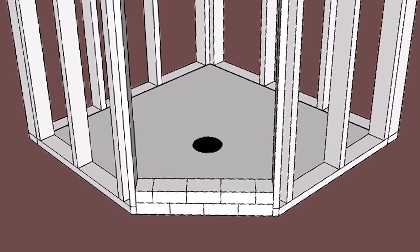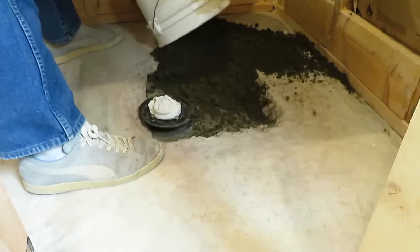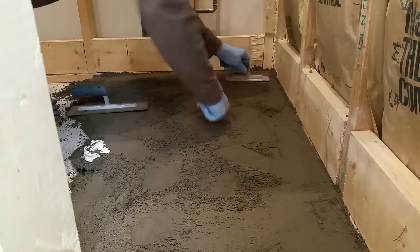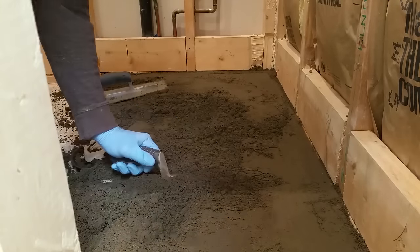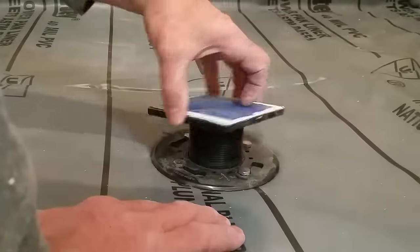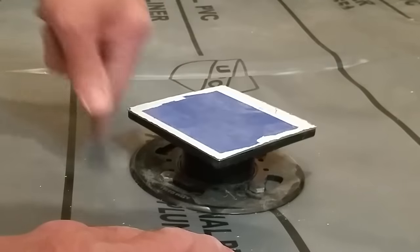After the brick step and shower drain are installed, a mixture of sand and Portland cement is placed in the shower floor and tapered from the outside wall down to the flange of the shower drain. In this case, I used the bottom plate of the wall framing as my guide. This layer provides a tapered base for the shower pan to rest on, so that in the event water ever reaches the shower pan, it would make its way to the drain. The shower pan is installed next and is tied into the flange with bolts that hold the drain assembly in place. The flange has a series of holes that allows water to make its way into the drain pipe should it ever get there.